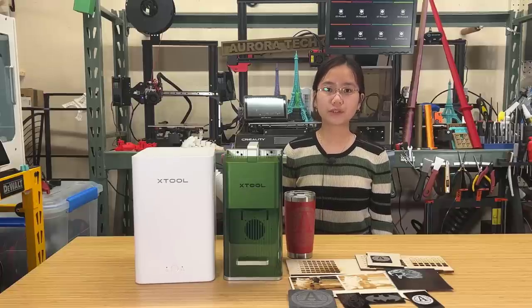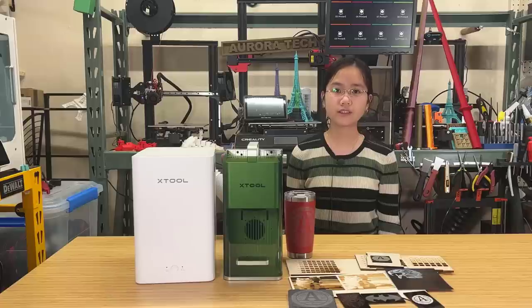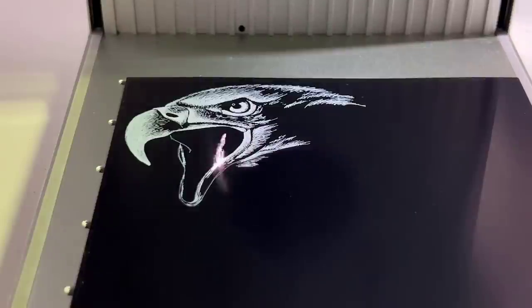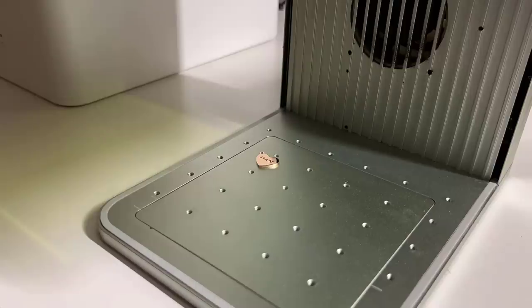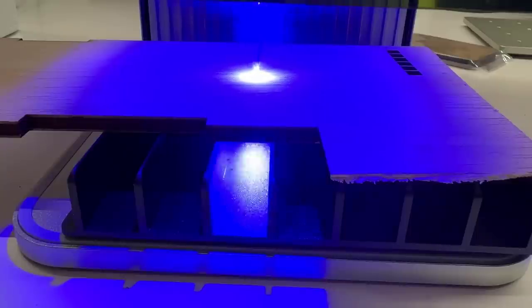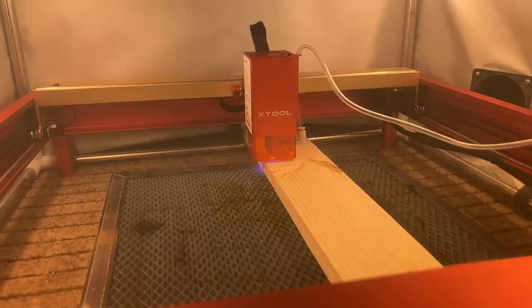Four: when it comes to image engraving, the software uses dot duration as a substitute for speed. I am more used to entering speed in seconds or minutes, so it may take some time to find the optimal dot duration settings. In conclusion, the X-Tool F1 IR and diode laser is ideal for working with small workpieces. It offers high speed and provides the convenience of drawing the outline of your job, allowing for precise alignment of tiny materials. The alignment feature surpasses the use of cameras in terms of accuracy. However, if your primary focus is working with wood and frequently cutting wood using a laser, this machine's size and type may not be suitable. In such cases, going for the standard D1 Pro 20-watt engraver would be the better option.